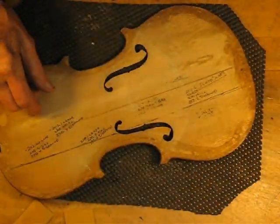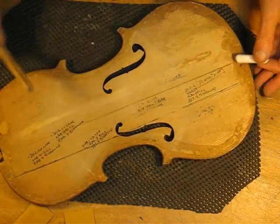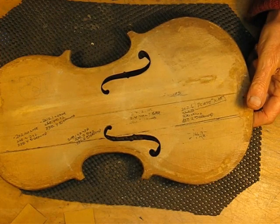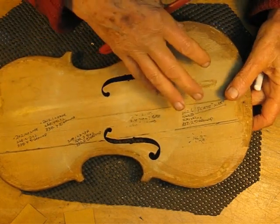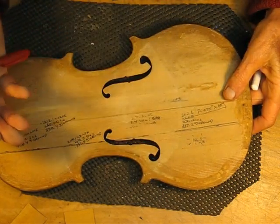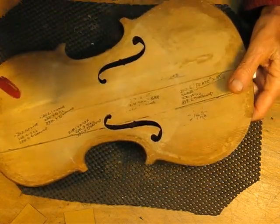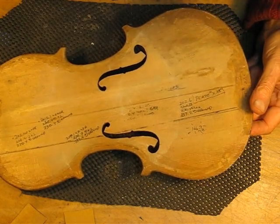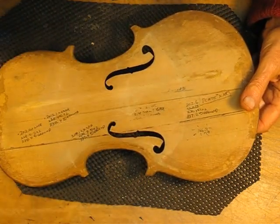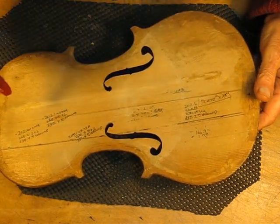We can find that with a simple piece of chalk and a tapping tool — you can even use the end of a pen. All we're going to listen to is the high overtones. When you tap on something, you hear a range of frequencies. There's the bottom frequency, what I'd call a fundamental tap, which we normally use. In this case, we're going to listen to the highest frequency, the highest overtone. When you listen, it's important that you simply listen. You don't talk to yourself — if you're talking to yourself, you stop listening. You just hear.